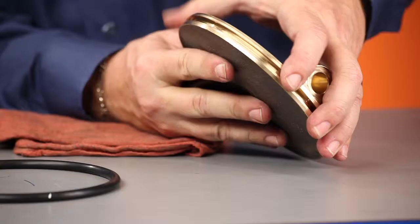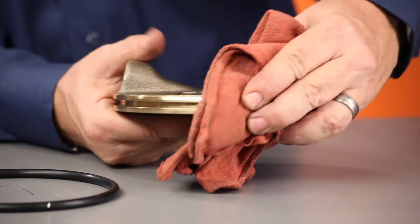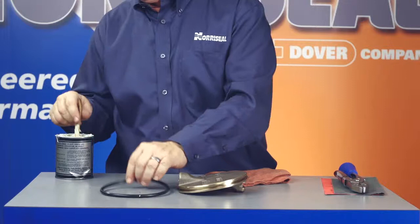The first step is to inspect the disc edge for damage. You should thoroughly clean the groove edges of any dirt and grit, which could damage the O-ring. If you need to, use an emery cloth to smooth the edges.